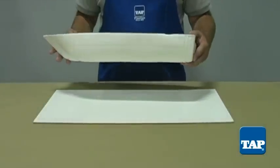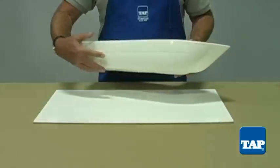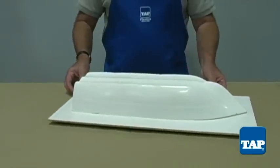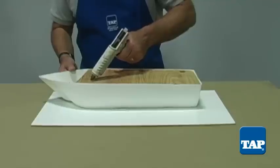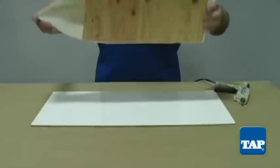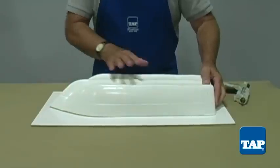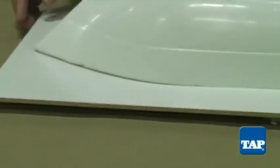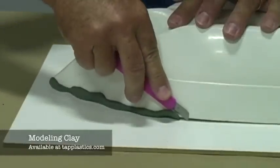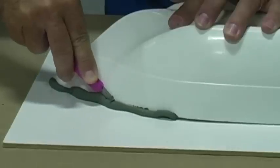The first step in making a mold is to mount the original part to a solid, non-porous surface. We are using a piece of coated hardboard. The mounting method will depend on your piece. In this case, we have glued a piece of plywood to the hull and will then glue that part down with a glue gun. A glue gun is ideal because it is fast and the glue can easily be later removed. After mounting the part, also called the plug, to a base, check to make sure there are no gaps between the plug and the base. Gelcoat cannot span gaps, so they must be filled. We will use clay. It can be pressed into the gap and then trimmed with a knife to produce a clean corner.